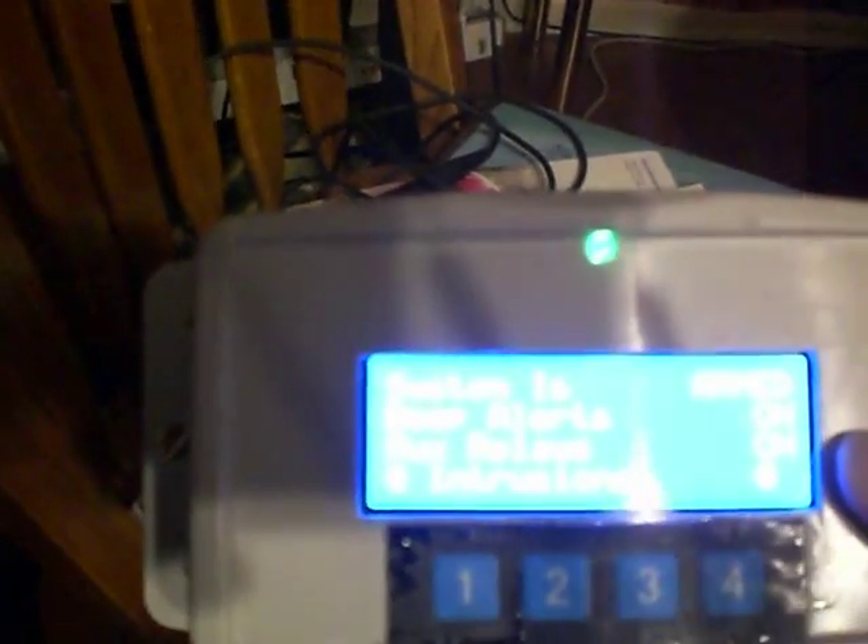You've got a keypad with four keys and an LED status light. On the back is a grommet where your power and communication cat5 cable goes in — so this would mount on the wall. The LCD times out after two minutes to save energy. Pressing any key will wake it up, or if there is an intrusion it'll wake it up. Any event will wake the screen up.